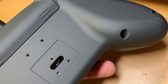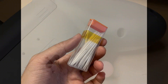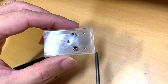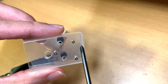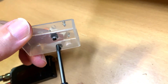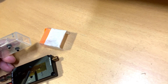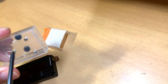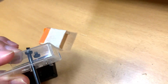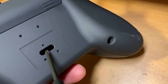To attach the amplifier to the back of the T-Lite radio we need a custom module bay, and here we are using a toothpick container. I've cut it down to a length of 4.5 cm and drilled 3 holes for the screws to attach it to the back of the T-Lite radio. I've also drilled 2 more holes for the screws to attach to the amplifier, so the screws line up perfectly. Two holes on the other side are for the screwdriver to turn the screw, and the big holes are for all the wires to run through into the T-Lite radio.